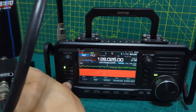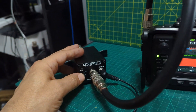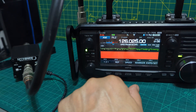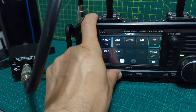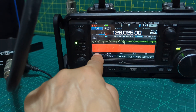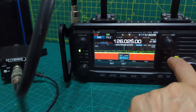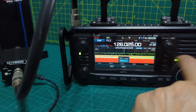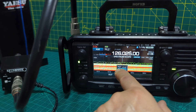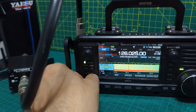Let's turn down the volume. Power's on, same antenna input. Now let's see if we can get rid of some of this scope overdrive. So we can wind down using the REF level — it will only go down so much. To bring it down more, we'll lower the RF gain.